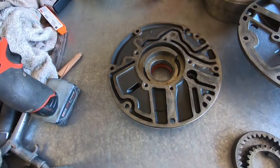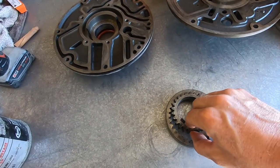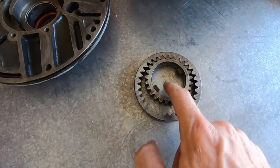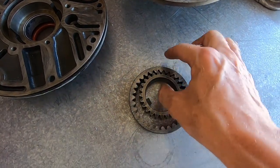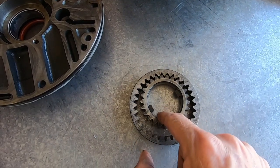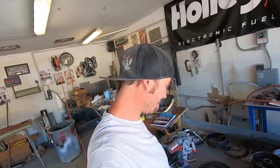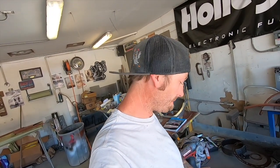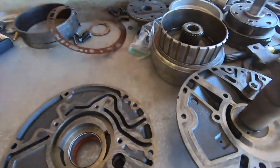Here's how to check the gears: you mesh them together and pull the inside gear — it should drag the outside one with it. Yes, we're going to say that's good. You put it on there, pull it, and it pulls along. If those two outer teeth are still catching there's enough left on the pump — we're going to try it anyway.